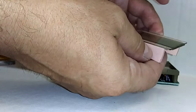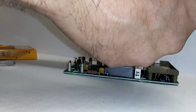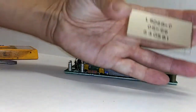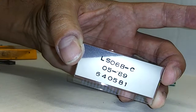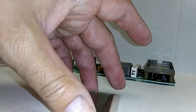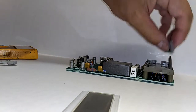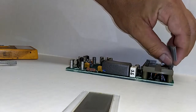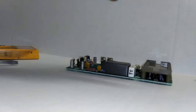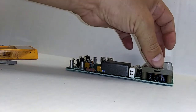Make sure you don't put the LCD back in upside down — let's tear these old elastomers off; we won't be needing these. This is the Fluke manufacturing part number on the LCD. All we're going to do now is drop in the new elastomers — just pop them into place — and we are going to reseat the LCD. Always make sure that you don't have your LCD in upside down.